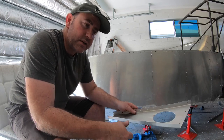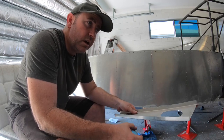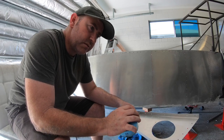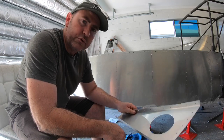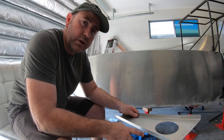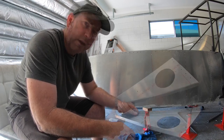The actual grip of the rotary hammer drill is against your leg. It's also got a clutch in this hammer drill, so if it actually grabs, it will just stop and you'll hear it vibrate. I'll get into it and drill one — I'll show you how I do a really good, nice hole. I'll try and simulate if it grabs.